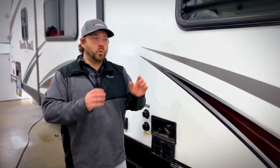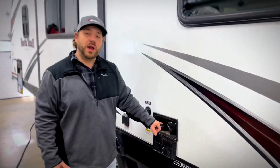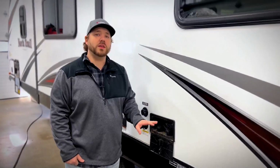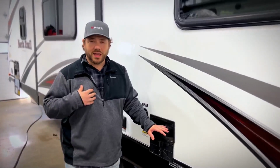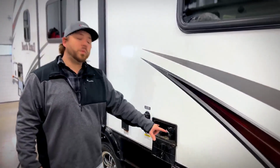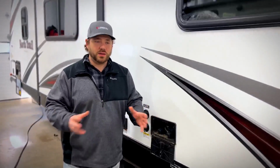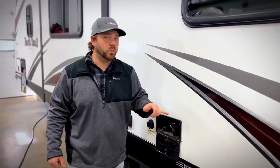These systems are all tied together with their water, so when water is put on board, it goes everywhere, including places that you may not use. So when you're draining, you do want to make sure that all the water is out of this, and then when you are putting your antifreeze in, or if you are taking it here to Kunes RV to get winterized, we will open these up, inspect, make sure everything has water out of it, make sure that that pink is dripping through the faucet and everything, because then that indicates that it has truly been winterized.